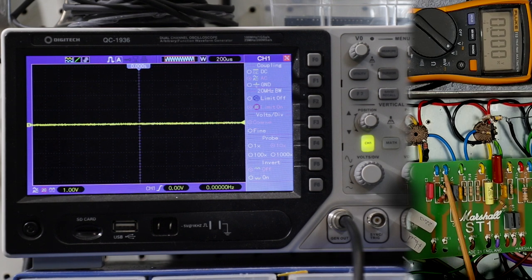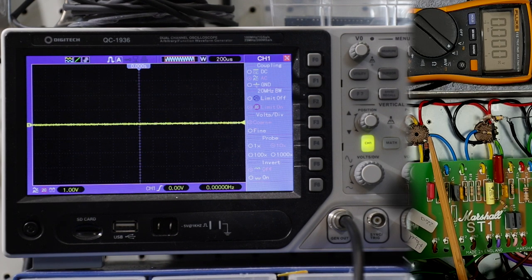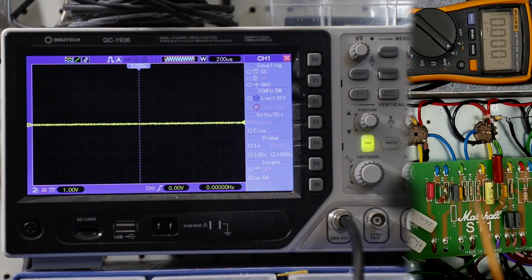So in the 2203, the first gain stage is actually V1B, right? So this side of V1, this triode, and in the stock amp, it's a 100K, right? We should all know this, 100K plate resistor on the first gain stage and a 100K on the second gain stage as well. Very common, right, to see a 100K plate resistor. So just for today's topic, we're going to look at what happens when this plate resistor is increased.